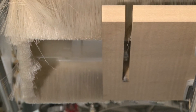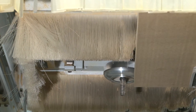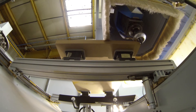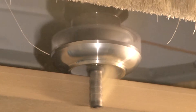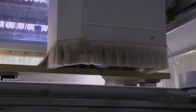It lengthens tool cutting life, as the shavings are extracted and the tool doesn't recut several times. It also lengthens the life of certain parts of your machining center by reducing the quantity of abrasive wood particles, which can latch onto the motherboard, the lubricated displacement axes, and the depression pump, and protects vacuum pumps due to diminished clogging of filters. The turbine is mounted on a hydraulic chuck for better concentricity and high-quality machining.